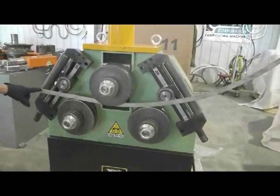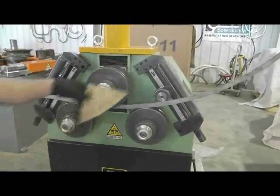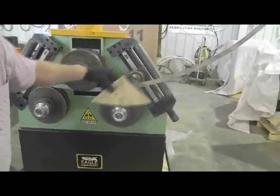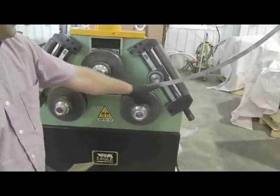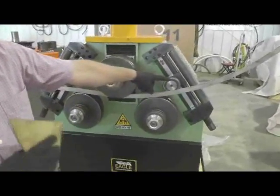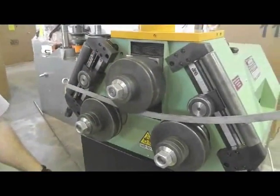I'll keep it maintained on the lateral guide. Let's compare our profile. I need to tighten this up, so I'll repeat the same operation and make adjustments. As I move the spinning roll down, the angle will kick up on each side, so I'll need to adjust up before I move my forming roll down. I need to release the tension off of this before I start back in the opposite direction.